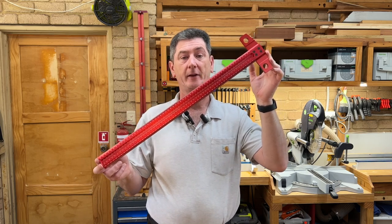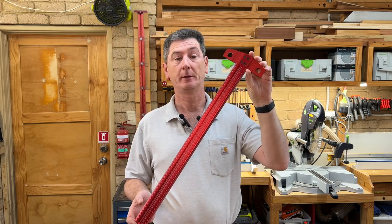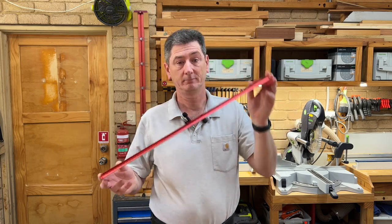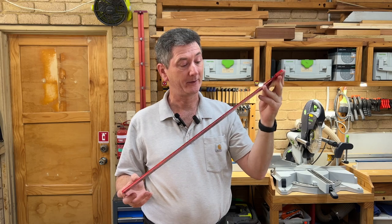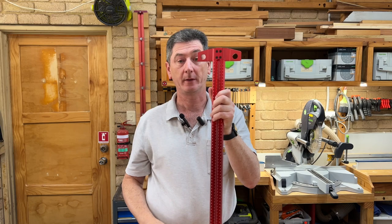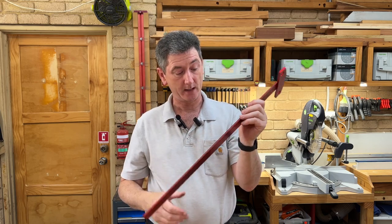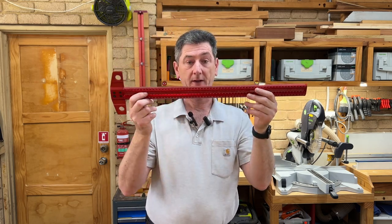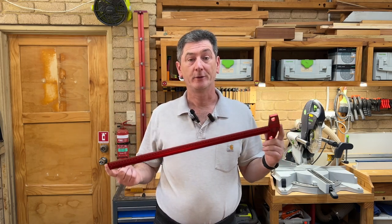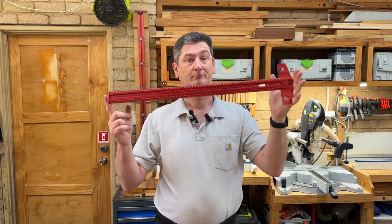First up is this T600 rule from Drill Pro — I bought this from Banggood.com, links will be in the description below. Some of you are probably thinking it's a direct rip-off of Woodpeckers; yeah, so be it — it does the job. It's nice and square, you can adjust the square slightly with these screws. It comes in two pieces when you first buy it. Screw it together, set the square, and once it's done it stays nice and square. The measurements are all very accurate — I've double-checked them against tape measures and other solid rules. A lot of MDF and plywood sheets sold in Australia are 600mm wide, so this is ideal because it's 600mm.